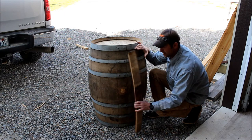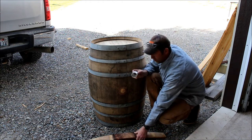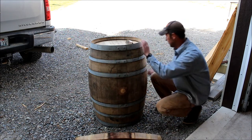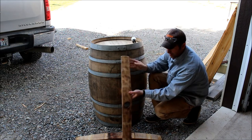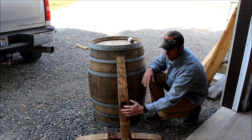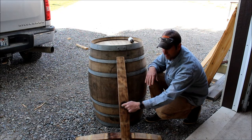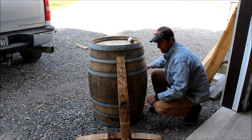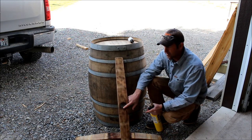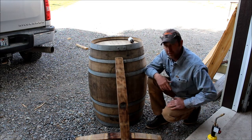What I like to do is take a two-inch hole saw and bore a hole in a few of those wider pieces, depending on where we're going to put them in the furniture. After I bore that hole it'll look brand new, but on the main barrel the bung will actually have stain all around it from the wine. You don't want it looking brand new, so I'll just take a torch and torch around in there - it blackens up really nice and turns out pretty good. Then you've got more pieces you can use with the holes in them.